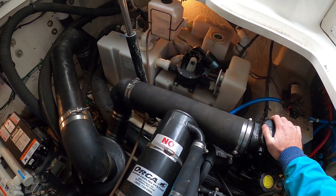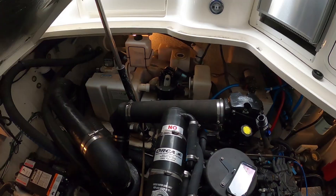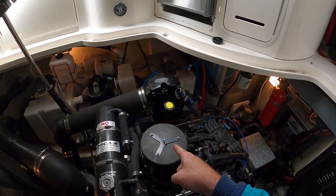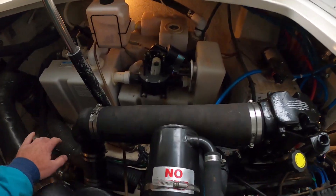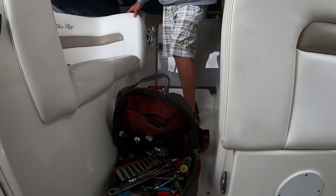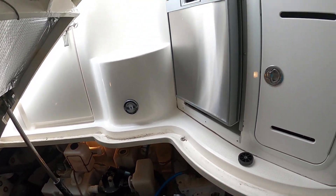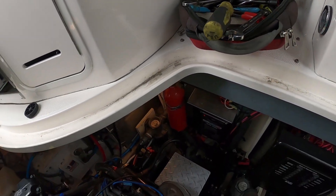You said you put this kit on — how old is it? About a year. I'm going to take the end caps off and see if there's any orange residue in them. If there's orange in the end caps, the leak is inside the heat exchanger. You might have a cracked manifold on that side, or it might just be coolant that dripped down. I'll fill it with coolant and see if coolant comes out the sides — how many times have you had to fill it?